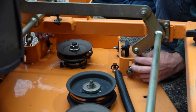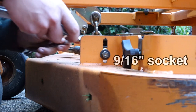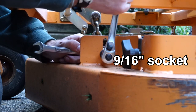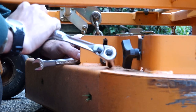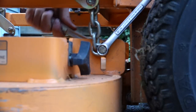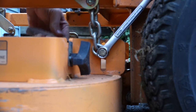Check the four deck chains to make sure they are loose. Remove the deck chains from the deck. It is easiest to remove the bolts from where the chain attaches to the deck, not to the mower frame. Remember to return the nuts to the bolts for safe keeping. Note that in each case, the socket is on the nut and the wrench is on the head of the bolt.